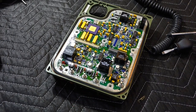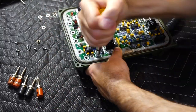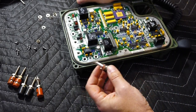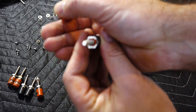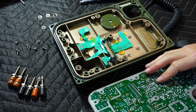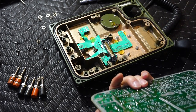Beautiful military stuff. The gasket is hermetic, and these are also sealed, so it's all hermetic everywhere. You can see the seal over here. The TA1042 is a pretty complicated digital phone, with data and switching capabilities, provided you connected to the right military switching equipment. Unfortunately, we don't have any of it, so the beautiful board is of no use to us.